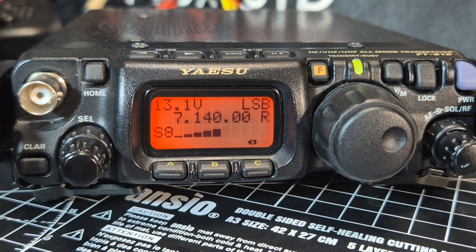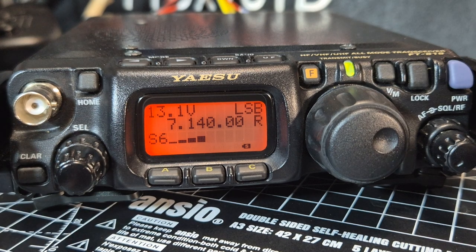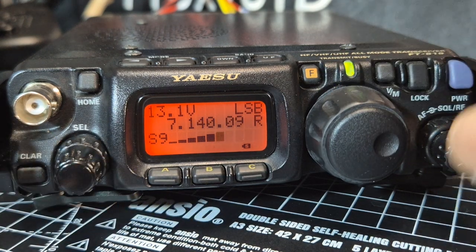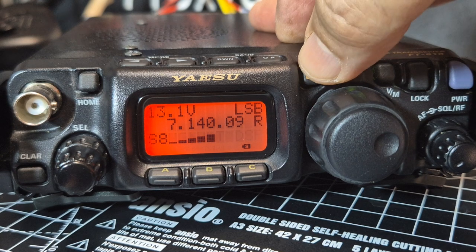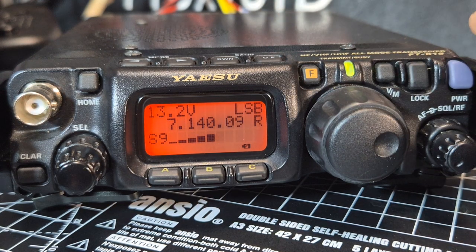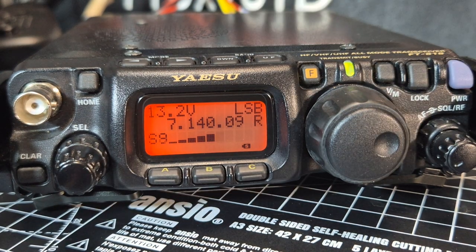You can use something like the SignaLink to do WSJT-X — just plug a cable into the rear data connector, which goes through a box and connects to your PC. You can do FT8 no problem at all, it's QRP FT8 but you can do it. Hopefully this helps you get started. The basics: volume, squelch, VFO change, up/down mode, up/down bands. Short press F for the sub-menu, long press for the main settings menu. VFO/memory for channels, lock button, power on/off, clarifier, and yes — you can charge the battery from this unit. Thanks for watching, bye for now.